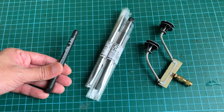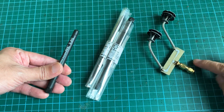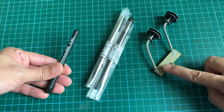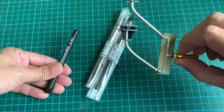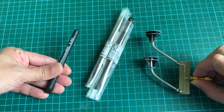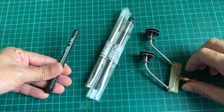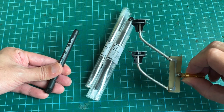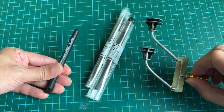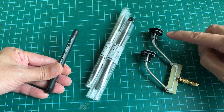Hi everyone, welcome back to my channel. In this video I'm going to talk about stacked Omni antennas. In my previous video I was able to stack a pair of Omni antennas — the Pagoda — using this PCB matched 5.8 GHz splitter or combiner. It matches the impedance of the two antennas together to output 50 ohms, making it a perfectly tuned antenna. The advantage is an additional 3 dB of gain, which basically doubles the signal of a single Omni antenna.